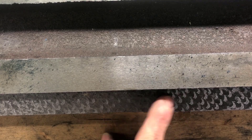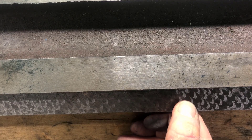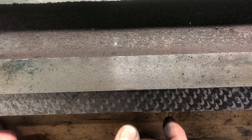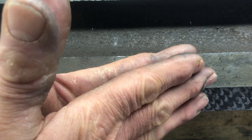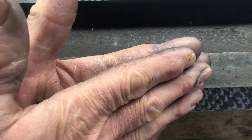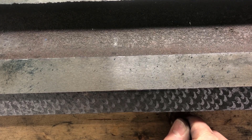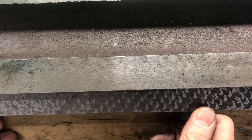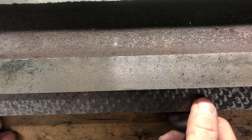The wavy pattern you see here is the factor that keeps the oil in longer on the part than otherwise — longer than if it were just scraped or just ground. If you have two ground surfaces against one another, you will squeeze out the oil, and then friction will cause the parts to stick together. If you have force trying to move them, you will have something called stick-slip, where friction stops the motion and then you overcome it and the parts scoot — giving you uneven movement. And of course you will have scoring and then accelerated wear. So this will prolong the usefulness of such a way system by having the oil in there longer. It is the lack of oil that really wears down the machine; the presence of oil is what allows the parts to glide.